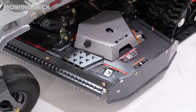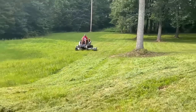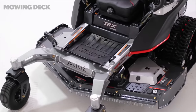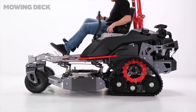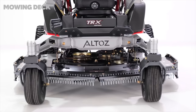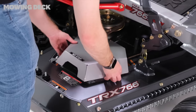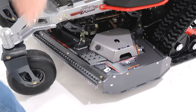You can even purchase both or swap them out. On the all-terrain deck, you can now purchase a deck extension kit that adds an additional 16 inches onto your mowing deck. The deck adjustment is a foot pedal plus dial system with a top lock for easy transport. The cut height variability ranges from 1.5 to 6 inches with quarter-inch increments. Access to the spindles is super easy — the spindles and bearings are the highest quality out there, and you get a stomp pad for stepping on and off the mower.